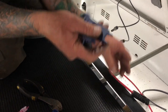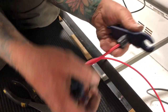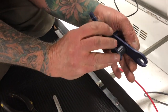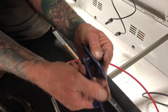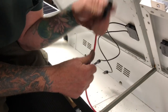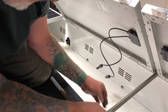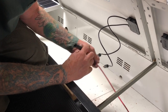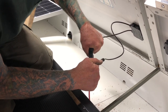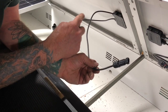When the outer ring screws on it cinches everything closed and makes it waterproof. Then it has these two little wrenches to tighten it all the way up. This is the positive side and we're using color-coded wire — positive on the front of the sets — so we didn't get confused. Our front panel positive plugs into here and then goes into the combiner box. Then this panel's negative plugs into the adjacent panel.